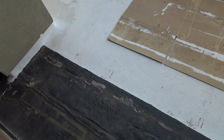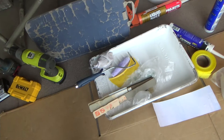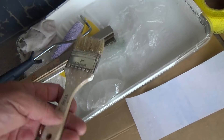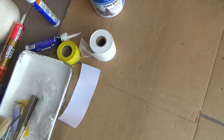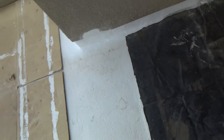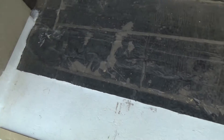I don't have roller covers for a nine-inch, and more than likely when I do painting I like to use a six-inch mini roller for my walls even on an accent wall. So I'll just use the six-inch. I'm also going to use my two-inch throwaway kaboom brush — I've been using it for this whole project and it's still in fairly good shape. I'll use that to cut in up in here and do all the borders of the flashings, the webbing material around the outside corners, inside corners and all that.